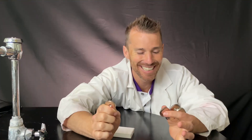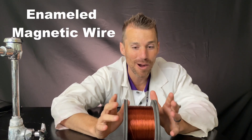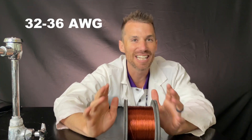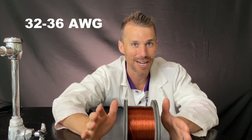I also got some really good results from these magnets. They come apart, but they look like that. You'll also need some copper wire. This wire is enamel coated, which is really important for projects like this, so the electricity doesn't jump between the wires. It's somewhere between 32 and 36 gauge — the marking rubbed off, so I'm not a hundred percent sure. The nice thing about the smaller gauge wires is you can get a lot for not very much money.